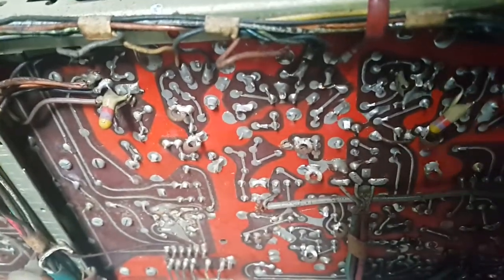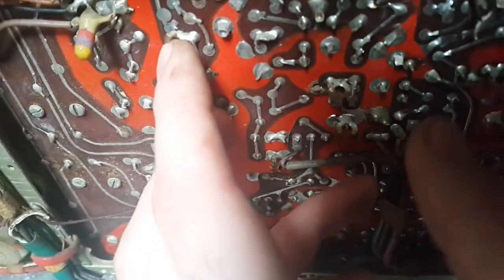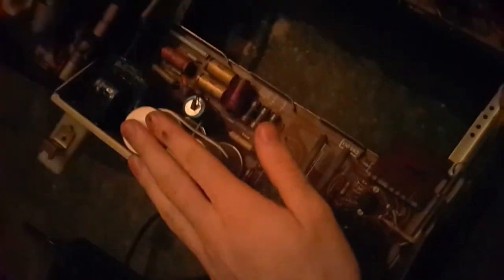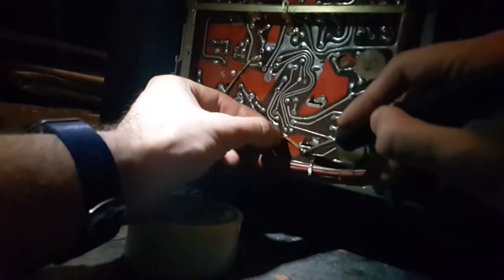Look at this. There's test points, but they're what looks like just washers that have been soldered on. So, as far as I can tell, there's only one paper and wax capacitor in here. We're gonna replace that. And perhaps, to deal with the electrolytics for now, we're just gonna turn it on a variable power supply. If it works, I think we should replace all of the electrolytics so that it remains working for a long time. Voila, it's in there. I almost forgot to replace this spring.